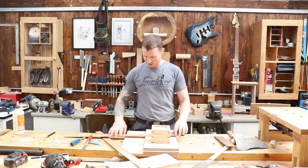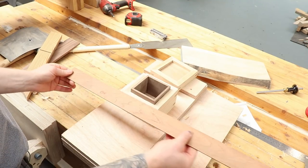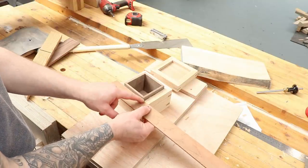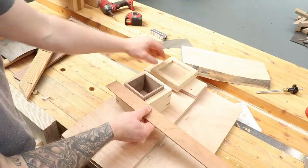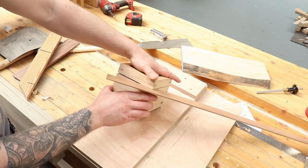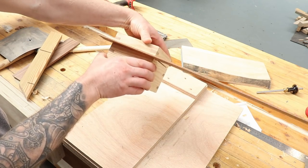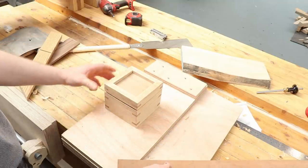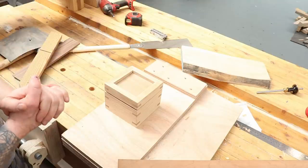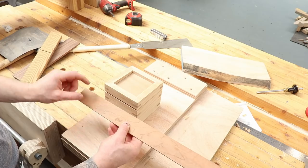Here's our piece of cherry — it has a nice little grain pattern in it. I'm literally going to mitre it and glue it all the way around, then use the lid to compress and hold it on. There shouldn't be any gap in there, and it'll be just the right thickness. We'll have a nice cherry line that will contrast between the ash lid and the ash box — less of a flaw and more of a feature. I'm going to take it to the mitre saw and cut my mitres.